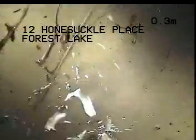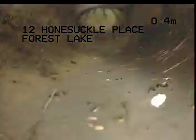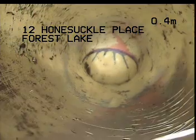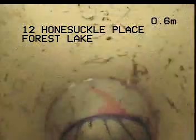Okay, so I've just jetted the drain and worked through it. I'm just at the bottom of that riser again at this junction. The junction is now clear. So it's on this junction here, as I say, that a repair would be required. We're actually down reasonably deep. I'd say we'd be down about 800 millimetres, so it goes down quite a ways. And then we're tracking across.